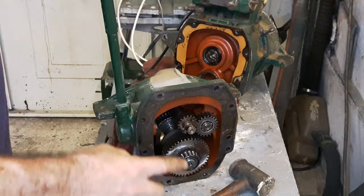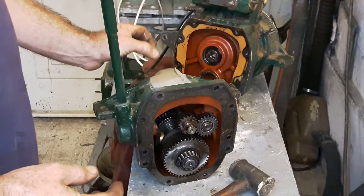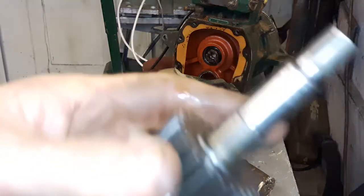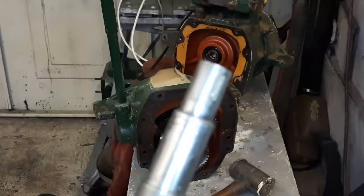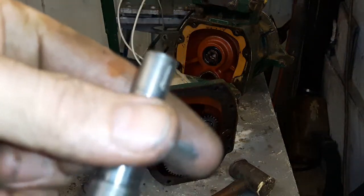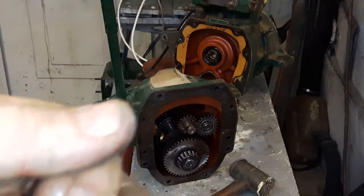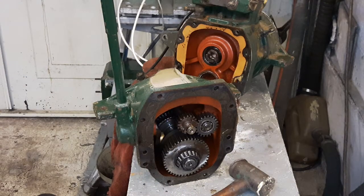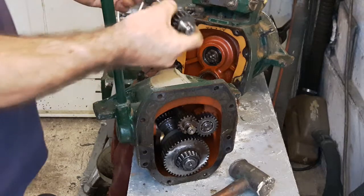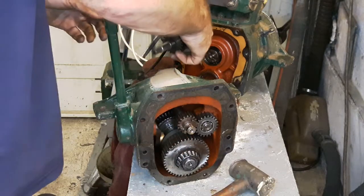The reason I'm so fussy about this is one reason: if that pump shaft gets stuck in there and you pull the box off, what happens is there's a Woodruff key in the end of this shaft. In the end here is a Woodruff key, and if that is dragged through the seals, the Woodruff key, which is sharper, can damage the pump seals as it comes out. Now if you're going to replace the pump seals, it's not a problem. But if you want to take this gearbox off just to have a look at something, you may have damaged the pump seals. So if I've supplied you a replacement gearbox, I don't want this pump shaft getting stuck in.